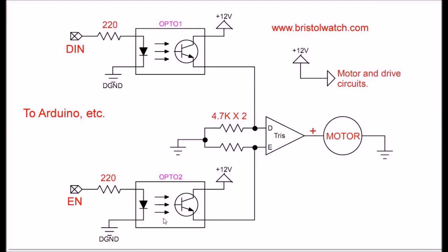As you may have seen earlier in the video, I'm also using optocouplers for input isolation. The inputs are being sourced from the 5 volt digital circuits — high in, high in will switch on the associated transistor for high out. There are those resistors to ground, and there's your data-in and enable signals, and you can switch on your motor and so forth. That ends this brief review of how to use optocouplers.